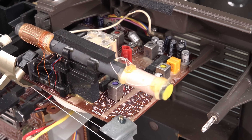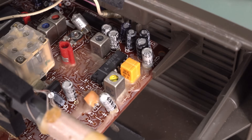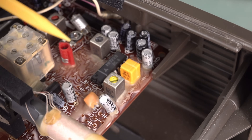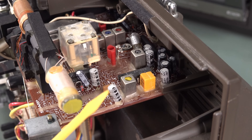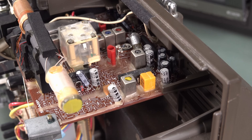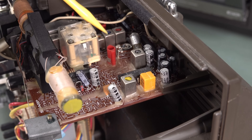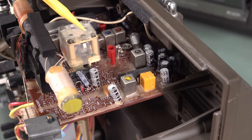We've got our single-sided PCB there. And of course you've got your classic wax down there — you can see the wax. That wax sealing is not uncommon: it holds down components for vibration but also fills in loosely wound inductors. Even though we have a nice inductor on a former here, it was very common to have loosely wound inductors just standing off the board. So they don't really need the wax in this one. Got a carbon trimmer in there, and a few trimmers in the back.